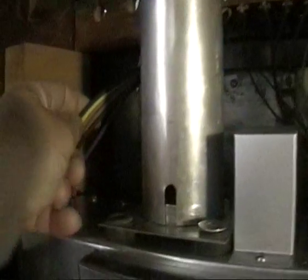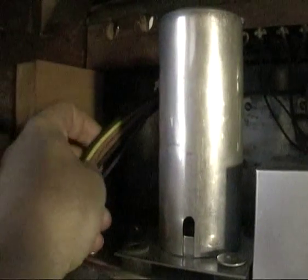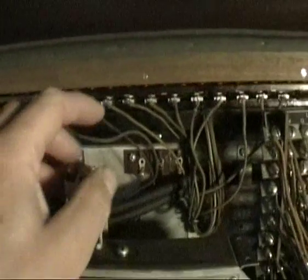Here's the mains wiring into the organ, from the connector box up to the start-run switches. These are modern replacement cloth-covered wires to replace the originals, because they handle mains voltage and the old ones were a little bit decayed. But all the other signal wiring, such as on the drawbars, is all the original cloth contact stuff and it's all perfectly sound and intact.